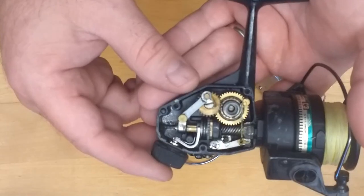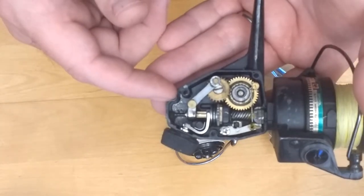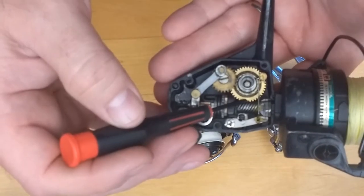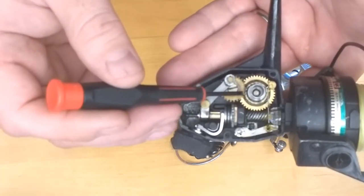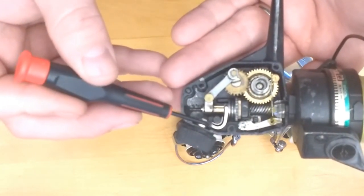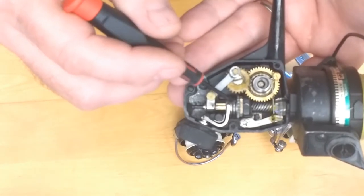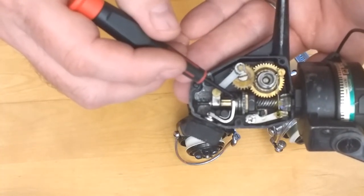Let's take a look under the hood. This reel is quite a bit more complicated than the other ones I showed you — in fact it's probably not any easier to service than many modern reels. But what it has that most other modern reels lack is this worm gear drive setup — brass gears, high-quality brass gears, high-quality steel pinion gear. It also has a fine tooth gear that runs the oscillation arm for a really tight line lay on your spool.